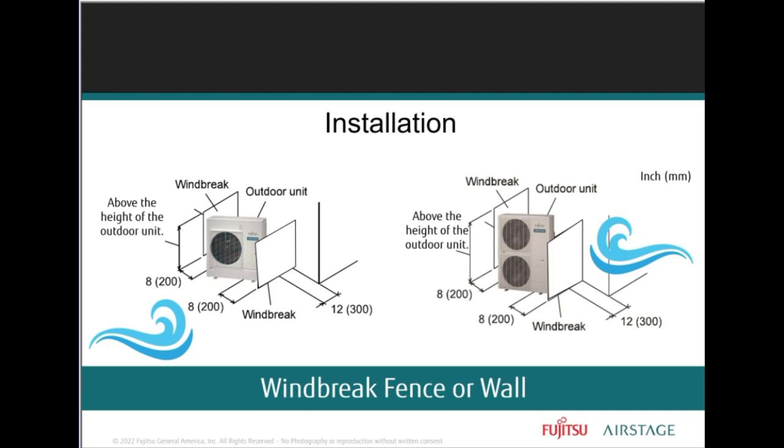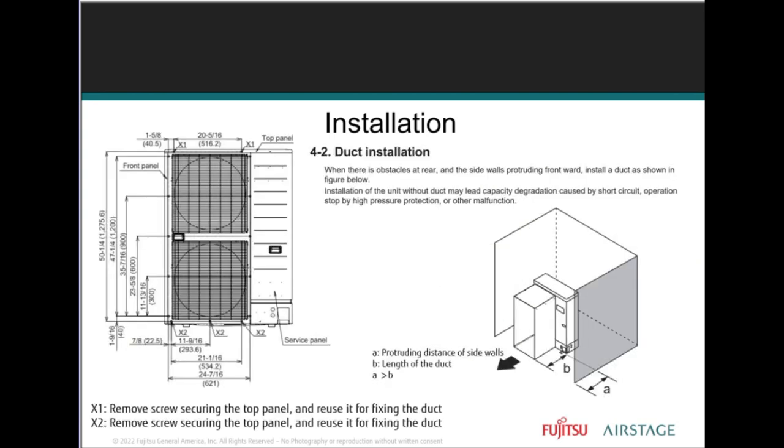Make sure that when installing the outdoor unit in low temperatures, low outdoor ambient, you use some type of windbreak or wind baffle to protect the outdoor units from the wind and drifting snow, or any high wind that could windmill the propeller on the outdoor units, especially the side propellers, right? Obviously this will help with keeping defrost cycles short and increasing system life expectancy, as well as efficiency, right?